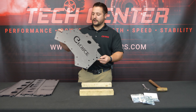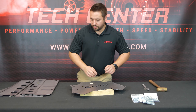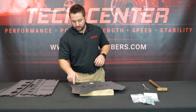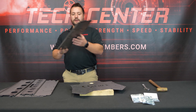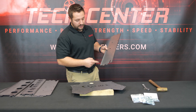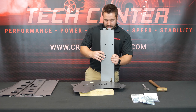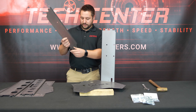All of our plates have laser etching in them which makes it very easy to assemble. You're going to take your back plate — for the LS block it's going to have laser etching next to all of the slots. Take the corresponding panel, this one is for a motor mount and it says BL. Line up the B and the L, make sure the reliefs are facing inward, then slide the tabs into the slots. Do the same thing for the other side, BR.